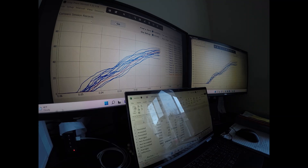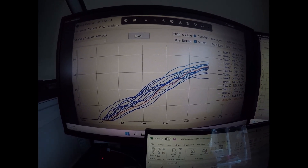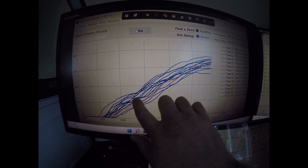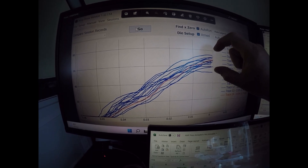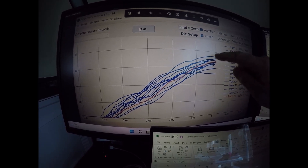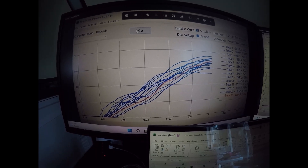I took the annealed brass and ran it through the amp press, and the annealed brass demonstrated this curve. If you notice all of the traces — the traces are basically the pressure curve — they're all pretty linear in shape. And if you look at the range of the overall pressure, they kind of fell between 60 and just under 80 in terms of overall final pressure.